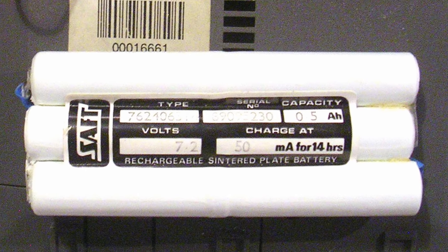The original printer battery consisted of six NiCAD cells in series, generating a nominal voltage of 7.2 volts. You might ask why I've used a DC-to-DC converter instead of simply using two lithium-ion batteries in series — since a lithium-ion battery's nominal voltage is 3.6V, two would give exactly 7.2V. However, NiCAD batteries only charge to a maximum of 1.3 volts and sit at 1.2V for prolonged periods before a drop-off, giving a voltage variation between 7.8V and the printer's cutoff.